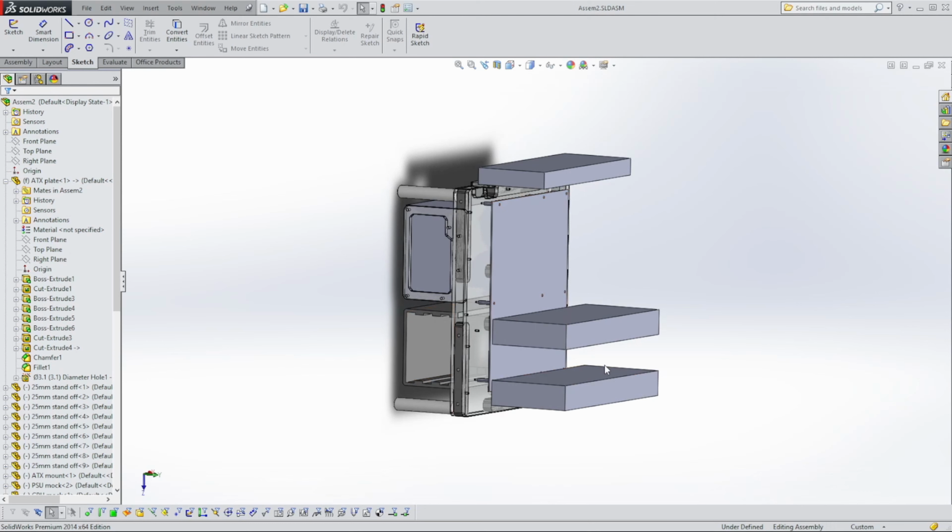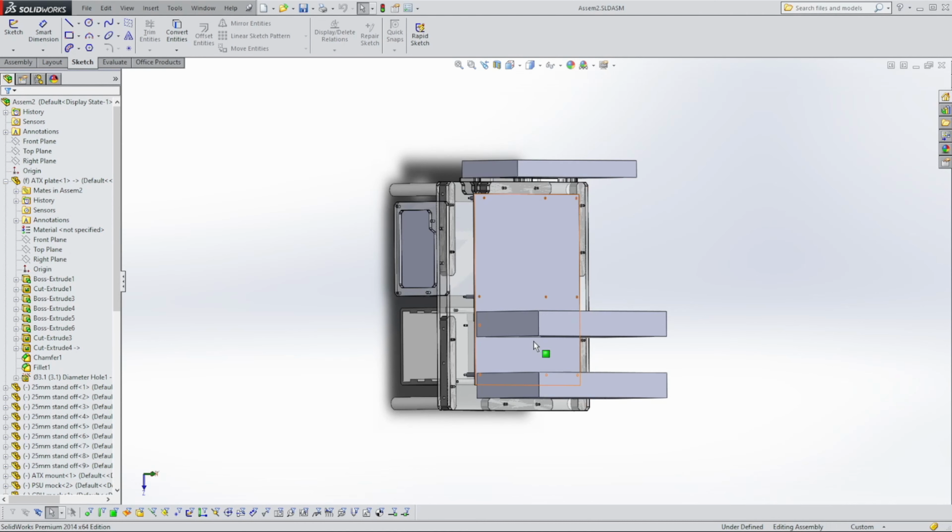And the way that I looked at this is, my case is already a fairly high flow case. And one of the issues that I had was the two graphics cards. The top one always ran extra hot. And when I say extra hot, like 10 degrees hotter. And fair enough, right? It's a triple fan design. It recirculates the heat and it isn't a blower fan design where it would send that air out the back of the case. So instead it just got trapped in the middle. So that wasn't something that I wanted, right?